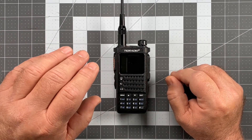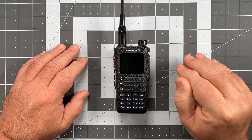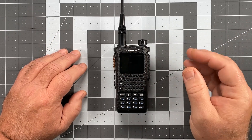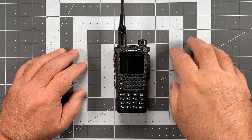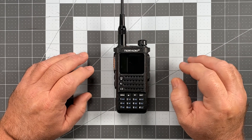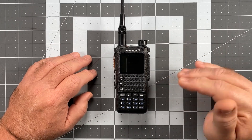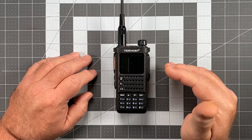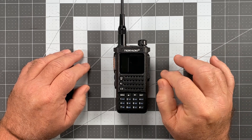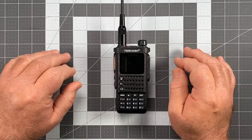You can set this radio up so that for Mode 1, the radio will be locked in — as far as transmit capability — into the amateur radio bands exclusively. It will not transmit out of the ham radio bands, amateur radio service only, although it does have wide receive of 136 to 174 MHz and 400 to 512 MHz for receive. For Mode 2, it's locked into the frequencies allocated by channel to the General Mobile Radio Service and will only transmit within that channel scheme. Mode 3 is going to be full expanded transmit — full ability to receive and transmit from 136 to 174 MHz and 400 to 512 MHz. So regardless of how you approach radio, you've got a channel scheme that you can set up with the TDH8.